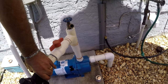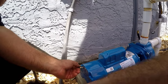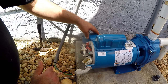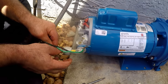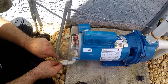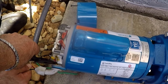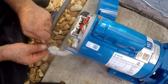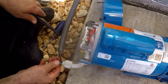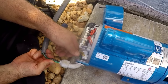While the cement is drying, we'll start the wiring. Take the back cover off. Before you start wiring, make sure you insert the wires through the waterproof elbow fitting first — it's a little tedious. You have to stick each wire in one at a time. The fittings at the end interfere: after the first wire, the second rubs on the other, and then the third, but it's doable — just take your time and be patient.